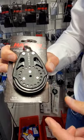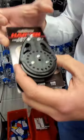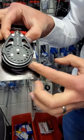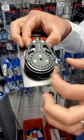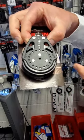The great thing about these is if there's no pressure on the rope then the ratchet won't engage, but as soon as you put pressure on it and the sheave pulls downwards, the ratchet will engage as the block rotates. So in those heavier conditions the ratchet will work, but when it's light it won't work.